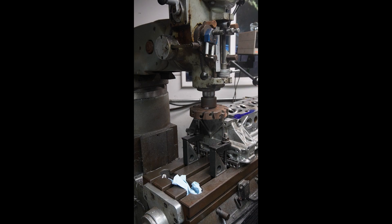I'm going to paint this with some Dykem. Back in the olden days, people used to make parts by painting Dykem on them, then scribing lines and cutting into the lines. I'm not that old so I never did it that way, but it makes a pretty good visual representation — it creates contrast between the shiny aluminum you just machined and the layout dye. I'm just going to smear this everywhere and then we'll sneak up on it, taking a few thou cuts at a time, and see where we are.